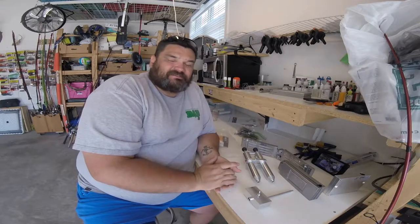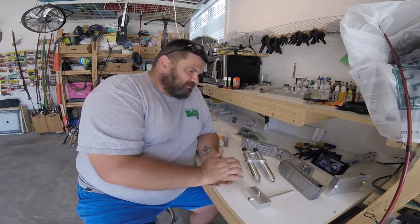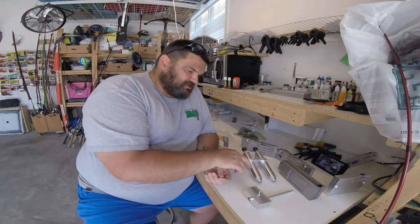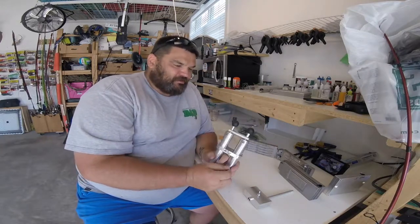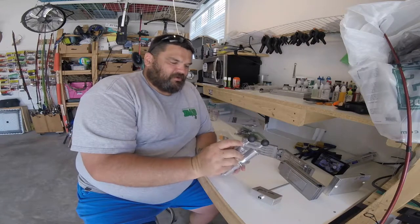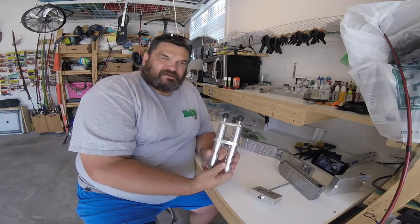The paint was like six bucks — Walmart, high-temp black enamel. I'm going to kill the camera, get set up, then turn it back on when I shoot these two molds. It'll be the first time with the new injectors from Do-It Mold. Each one is a four-ounce. You can take them apart — it comes with a little allen key to undo the crossbar. And you just pull the wing nut out, pull the clamps off, and you've got two single injectors.